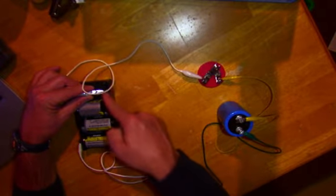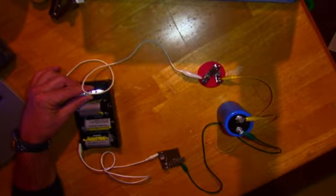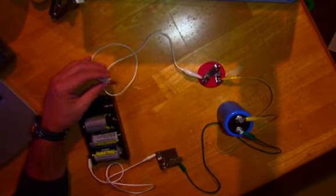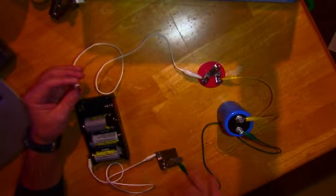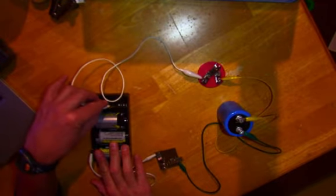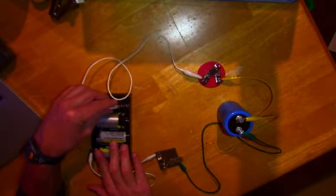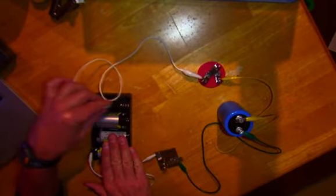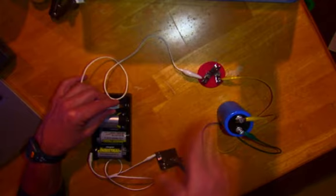I'm still connecting to the red springs over here. The bulbs are no longer lit. So I guess we have to circle yes that the bulbs lit for circuit B, but maybe we need a disclaimer, an adjective. Maybe we should add the word temporarily. Well, in the predictions, it suggested that we hook up circuit B a second time. So that's the battery pack, wires, bulbs, and the capacitor. Let's go ahead and touch B again. 1, 2, 3. The bulbs don't light a second time. And if I do it again, circuit B, circuit B, the bulbs are not lighting.